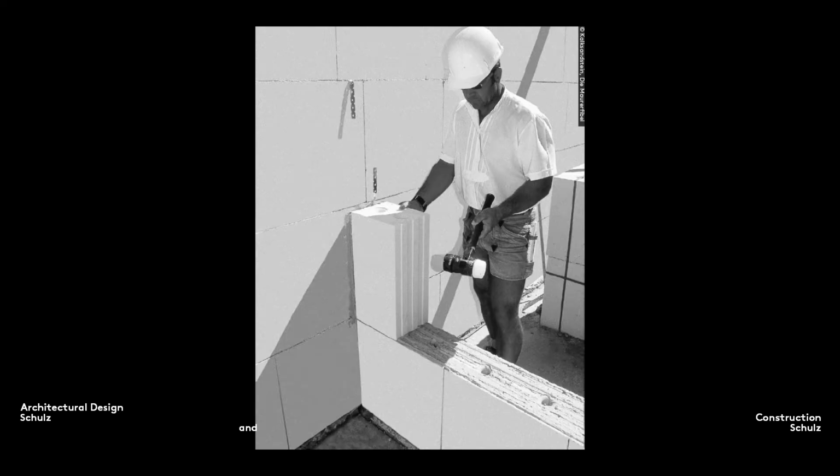As an alternative to traditional mortar, bricks and blocks can also be joined using so-called thin bed mortar. Joints made using this type of mortar are only a few millimeters thick and are always horizontal. The strength of the butt joint is guaranteed by the use of interlocking blocks. Walls made using this technique are sometimes called thin joint constructions. The rest of this series restricts itself to traditional mortar-bonded walls since they best illustrate the principles of brick and block masonry.